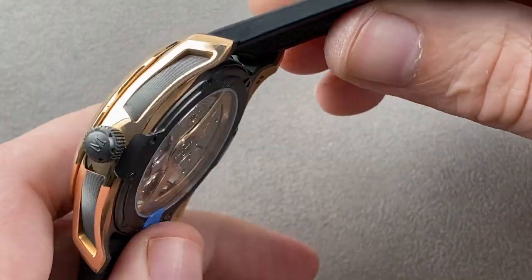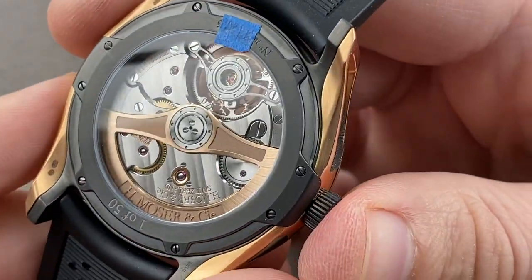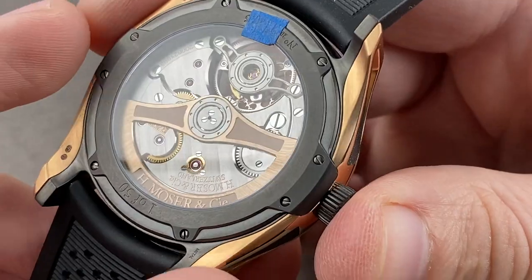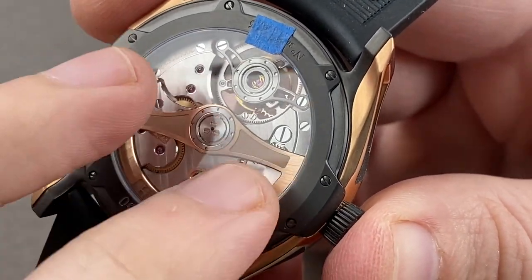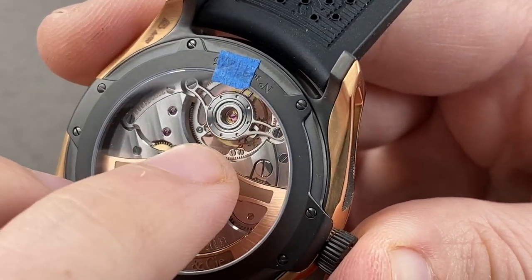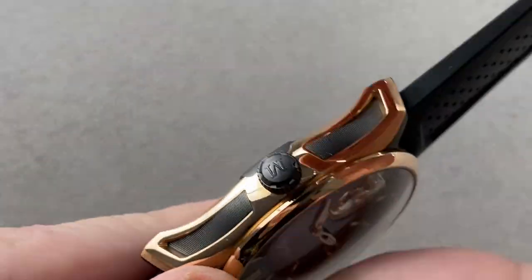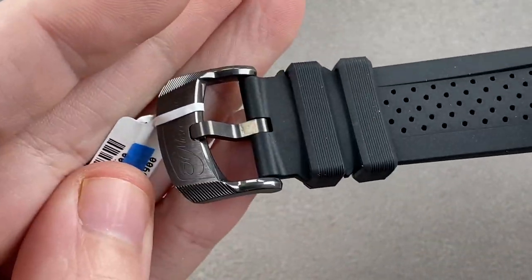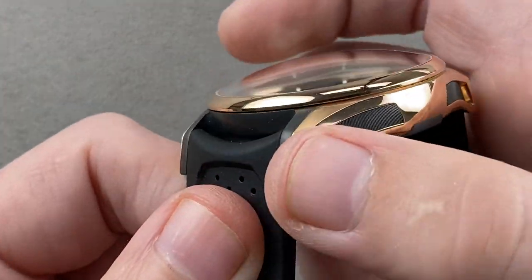Now, this is a remarkable watch because it's an automatic tourbillon in addition to its other refinements. You can see it's one of 50. It's a limited edition. We have a golden chaton held by black polished screws that holds the barrel arbor. The bottom of the tourbillon is braced by a ceramic ball bearing, and then we have a Magic Lever-style pawl-based winding system. It even includes a matching blackened titanium pin buckle, and you can see that the striations of the buckle match the coining of the case flanks.